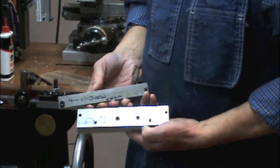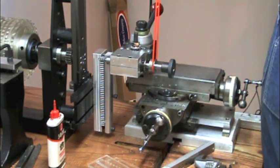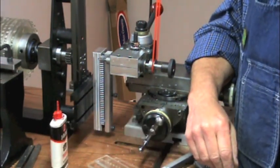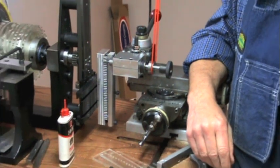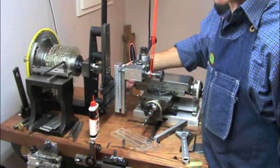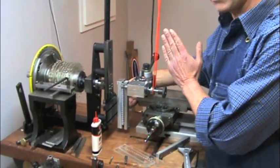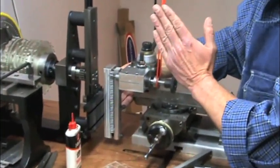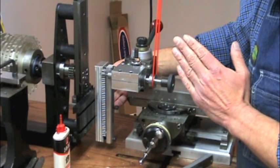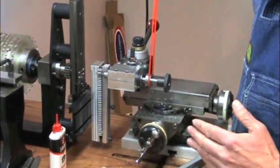This is the setup for the shown side. In tool steel, I would crank up the RPM as fast as it'll go, add a few drops of oil, and take it nice and slow on each cut. If it's taking a little too much, always back it off. When backing off, remember: always use the cross slide to cut — never use your hard edge cross slide to feed in. Once you're on center line for cutting your pattern bar in the center of the machine, always leave it there. If you use your hard edge cross slide to feed over and get too far off center, your pattern will be slightly distorted. So always feed from this slide right here.